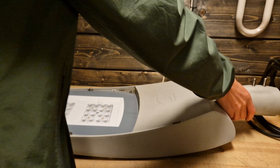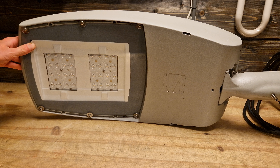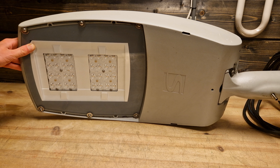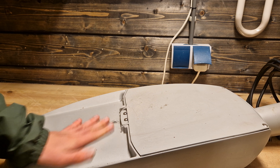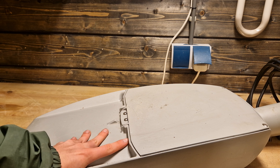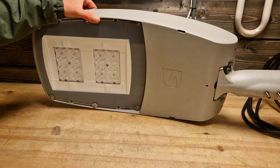This is the Teseo — you have three sizes, and this one is the middle size. The biggest version is actually quite bad in my opinion; it has a lot of LED and driver faults because it doesn't really have proper cooling. This fixture doesn't have great cooling either, but since the LEDs aren't using too much power and not getting too hot, they work fine.